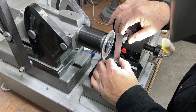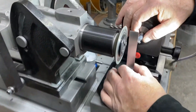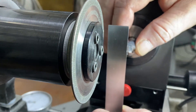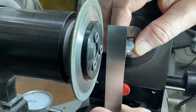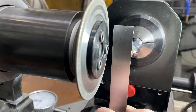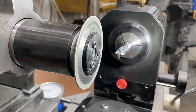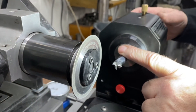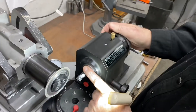When you time the tool, you kind of want it a little advanced — advanced being towards the wheel. Because as you grind the tool, you grind around the helix, and when you remove the end, you're actually rotating the tool. So set it up nice and square, maybe a few thou advanced. I'll just put my finger on that so it doesn't move when I tighten it.